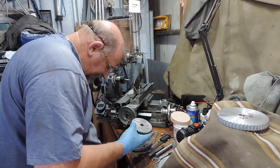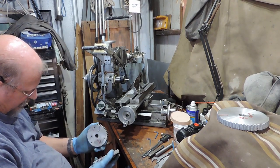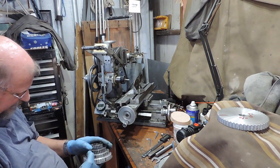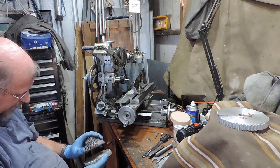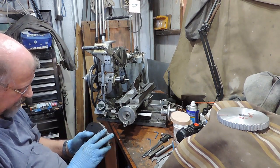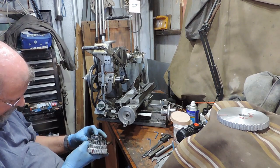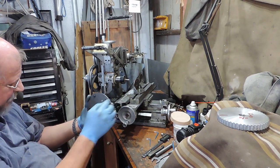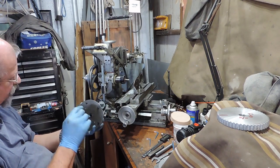That's the rest of the pulley setup — I've got to pull that apart so I can screw that one on, because it screws that way. I've done the dog drive in the back here but I forgot one thing: this dog drive has to be timed or clocked to the position of the set screw that holds the gear in place. Once I've lined that up, this has to be in the position to line up with the peg.